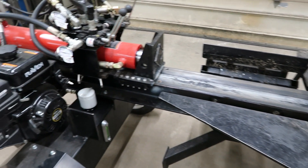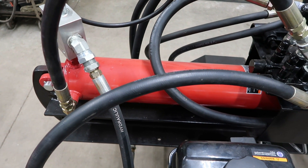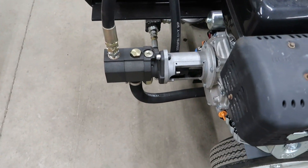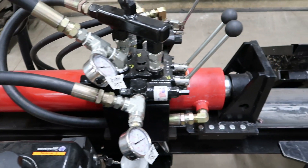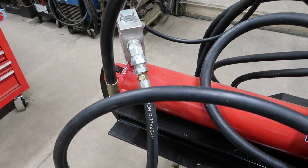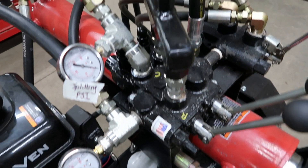From my calculations, I'm trying to force about 55 to 56 gallons a minute coming out of the base port when this thing is retracting. This is a 28 gallon a minute pump, and calculating that out on the retract, this valve body is only rated at 25 gallons a minute. So that dump valve is taking half of it, if not more.